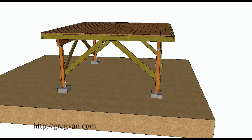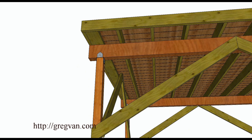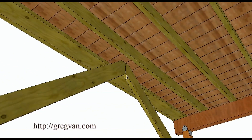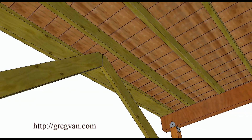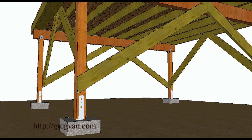The braces should not be more than 45 degrees. For example, if you had a brace and you went up creating a 60-degree angle, you're not going to get as much strength. I would say you want to be between 45 degrees and 30 degrees — something like that would provide you with the most structural strength, but that is just my best guess. Pay attention to how I connected it here, as this might require additional wood as stated in the previous section.